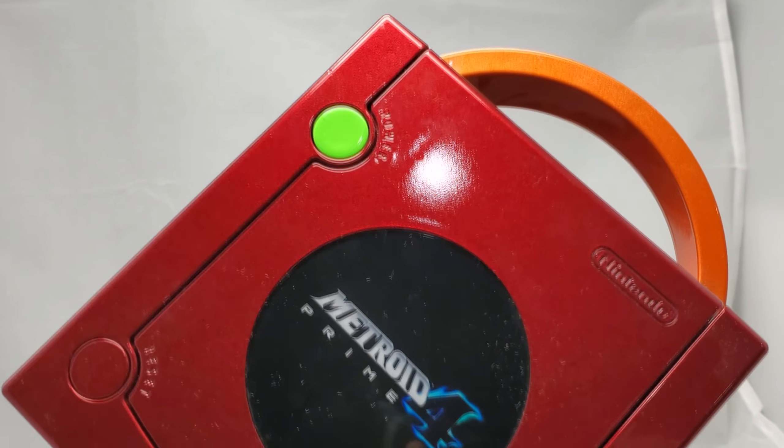After doing a bunch of test prints, I wanted to test some of the features of the printer. I tested the filament runout detector using the test filament included with the printer, and sure enough, it worked exactly as it was supposed to. Next, I wanted to test the claim of it being silent. While I don't have a proper way to measure decibels, I did compare the noise coming off the printer to that of my Creality Ender 3 Pro, and there's an appreciable difference in noise levels, which validates that the 32-bit motherboard along with the quieter stepper drivers does make a difference in noise volume.